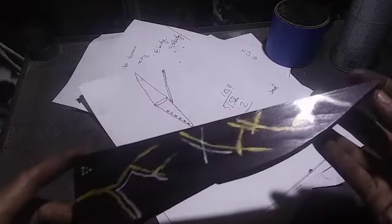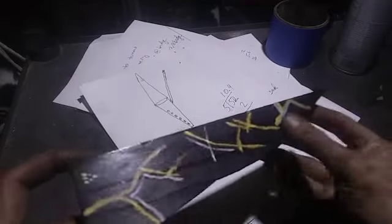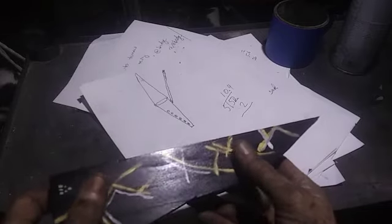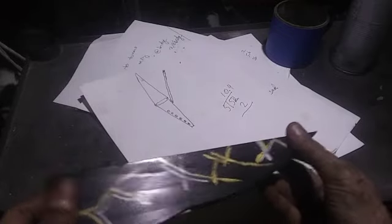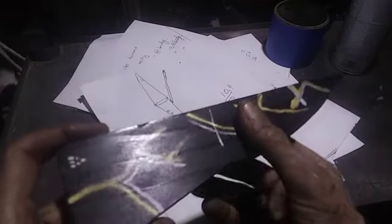Okay, this is after two coats of lacquer, and it's starting to build some sheen, and you can see some grain, and I think this is right about where I want to be with no sanding whatsoever. So yeah, I think this is what I'm gonna shoot for, as far as the level of clear coat goes. Two coats of lacquer, no sanding. Gotta remember, the guitar, not this stuff, but the guitar has been sanded back to 320 already, so it's actually smoother than this thing is. So, yeah, now, and I've been practicing.